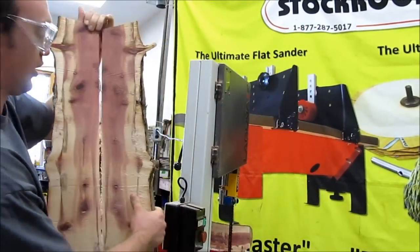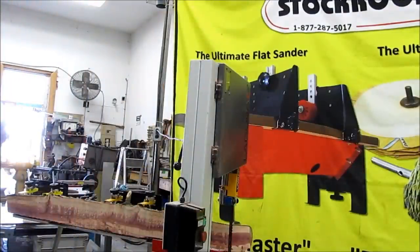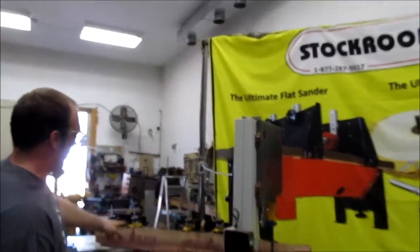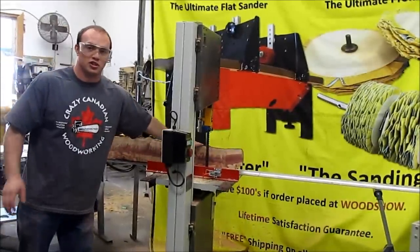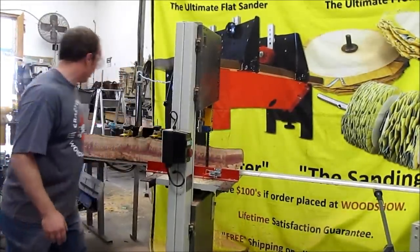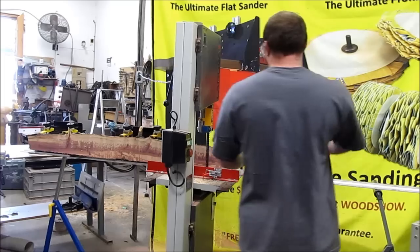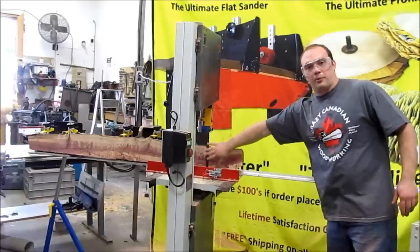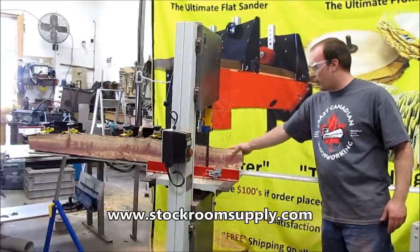So yeah, that's the sawmill package. My limits would be, I can do about 8 feet long. Now the way I had this one set up particularly, I had too much of the log set to the outside here. I should have this little ripper right on the ends. That was just an oversight on my part, but that's okay, it still worked. So I can do about 8 feet long and about 14 inch diameter. That's the full capacity of this saw anyway. So basically the capacity of whatever your saw is by about 8 feet long. And that's what we call a sawmill package.